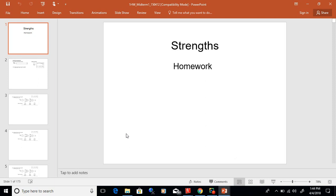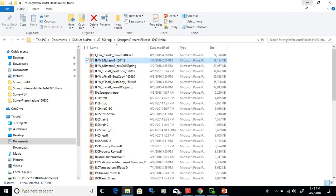Stress, and then to find E, just divide it into the strain. And when you do that, what you're getting is the slope of that linear part of the graph. See, what that E value does is it allows you to, if you know stress, you can find strain, and if you know strain, you can find stress. It links the two together. And that's a real common idea in this class, the relationship between stress and strain. We use that a lot in our work when we're doing structural stuff with these materials.